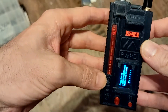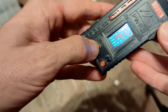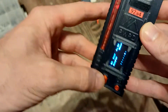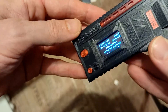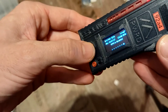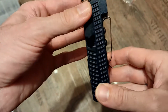What you just saw is the LED light bar that you can configure whenever you get a message — it blinks and is really, really well visible. We already have a GPS connection. It needs a while, but oh — GPS is already working! We got a fix already: five satellites, altitude, everything. When you press the button three times you can turn off GPS — you don't need an extra switch for that. Pressing three times again and it's on again.